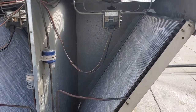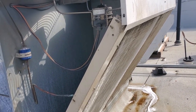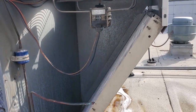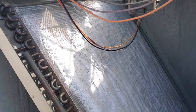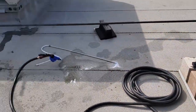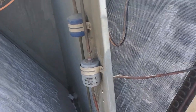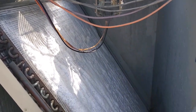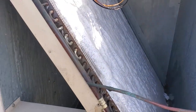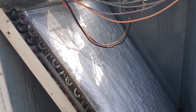So it's important to understand how to apply coil cleaner. The first step is clean off big debris, then wet the coil down from the inside out if possible. Get it nice and wet — have a smooth surface for the coil cleaner to move. If it's not wet, the coil cleaner has a hard time moving across; the water kind of lubricates the coil. Next, apply on the lowest setting on your coil gun — I'm using the E setting. Apply coil cleaner from the inside out and let it sit and penetrate. Then after it's sat for a little while, go to a more concentrated setting and apply it again from the inside out, then apply from the opposite side also. Let it sit and do its magic, but you don't want to leave it on too long depending on the cleaner you're using. Right now I'm using Nu-Calgon Nu-Brite — very corrosive, very fast acting, and very dangerous coil cleaner because you have to get it off fast.